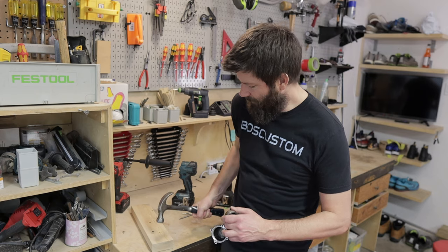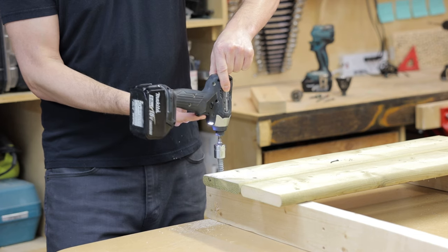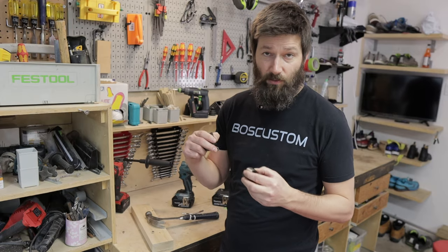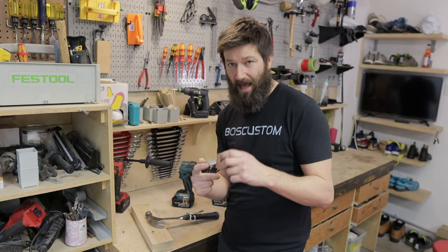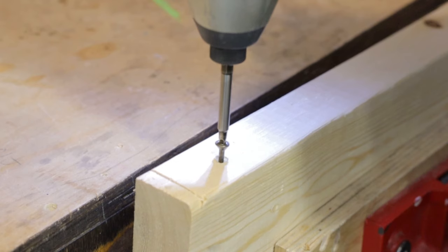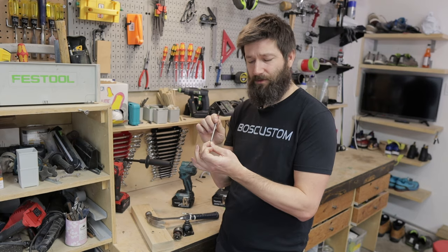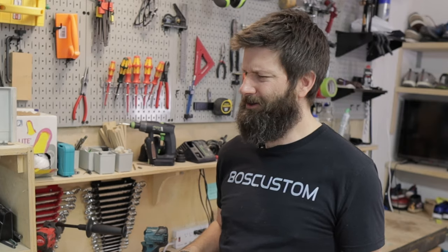It's the same thing in this impact driver — this little thing strikes the little T, boom, supplies the rotational force, then snaps back down. As it snaps back down, it puts a little bit of pressure on the bit so the rotational force is taken off, and then it gets a little tap to seat itself back into the screw. That's why impact drivers don't cam out nearly as much.